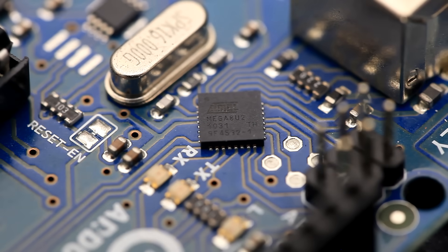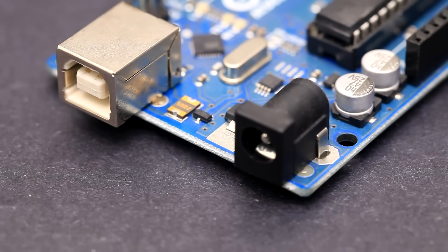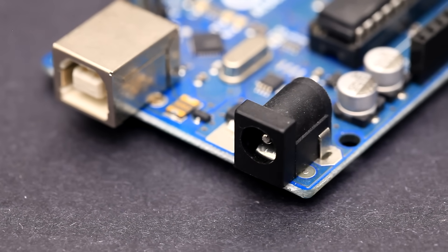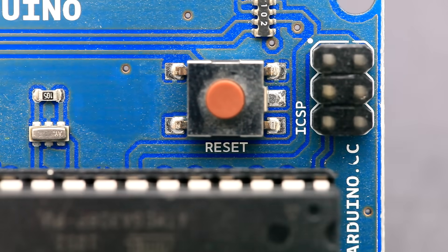In order to upload the software you create to the main microcontroller, there's actually another microcontroller. This chip is what lets you connect your USB cable to the Arduino board and communicate via USB. It lets you upload your programs onto the main microcontroller, and once you have your program running, this chip is what allows you to send messages back and forth between your computer and your Arduino — extremely important for debugging. One great thing about Arduinos is that you can power them purely from your USB cable. But if you don't want your project always attached to a computer, you can use an external 9V DC power source with a barrel jack. The Uno has a built-in voltage regulator that'll reduce the voltage to 5V, and if you ever want to reboot your Arduino's program, you've got a reset button.